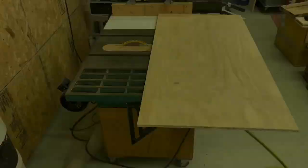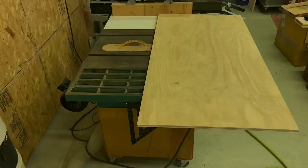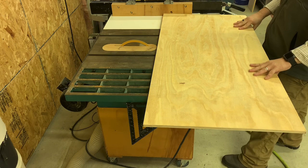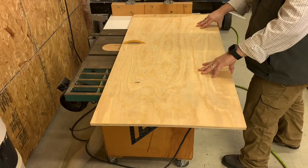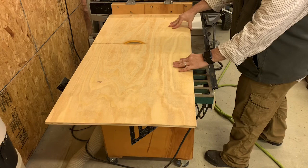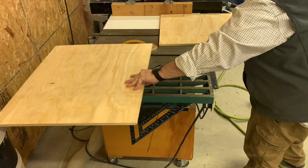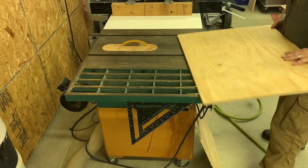We're going to take the piece of plywood and rip it twice on the table saw. The measurement is approximately 9.5 to 19.5 inches, which is the width of the bottom board and two one-bys. Note that one-bys are slightly less than one inch, so measure the two sides with the 18-inch piece nested between them to get the correct rip width.